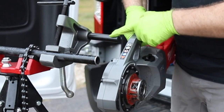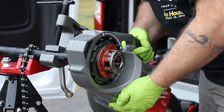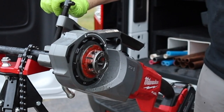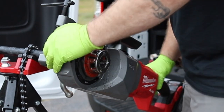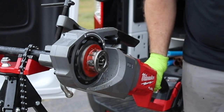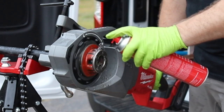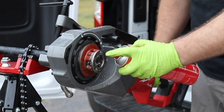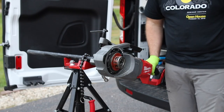As you can see, this bar is going to fit in this hole in the tool right there. Line the die up onto the pipe and slide it on. I'm in speed one for threading, and I'll switch it to speed two for reversing it off.